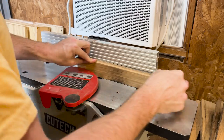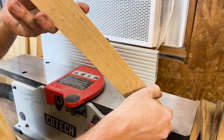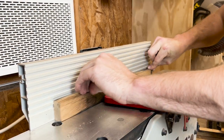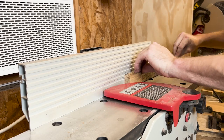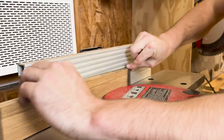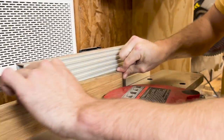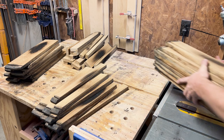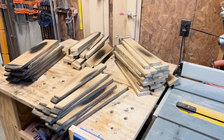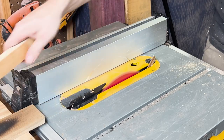After the pieces were perfectly flat, the edges still weren't, due to the staves having angled edges to be able to make that curve for the barrel sides. So I headed back to the jointer and this time turned the stave on a 90-degree edge. Doing this does take a lot of the outside weathering and char off the staves, but there's still some residual that wasn't completely removed by the tools. After this was completed, I needed to square up the last side of the stave, so I used my table saw, putting the jointed side on the fence and ripping the last angled portion off. After I ran all the pieces through, I had my stacks ready to glue up.